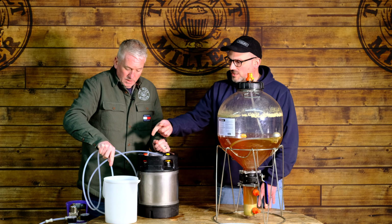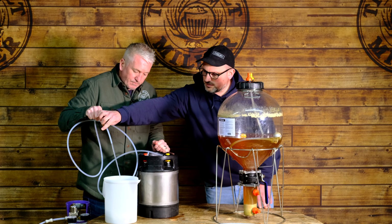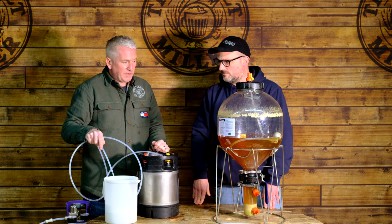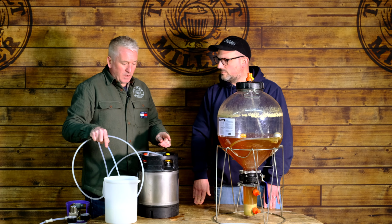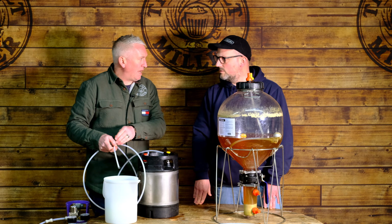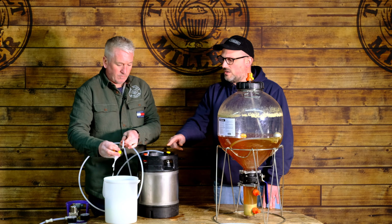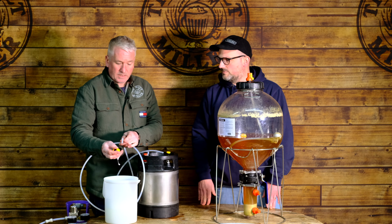Right, and so we can see we've got liquid sanitizer flowing through. Just lift that up. There we go. And we're going to dump all of the sanitizer out, right? We're going to dump all the sanitizer out, yeah. Once we've done that, we are going to do the same with our gas line. So we know now that by dumping that out, we've purged it of sanitizer, and that's now full of CO2. Yes.